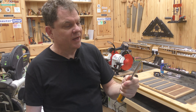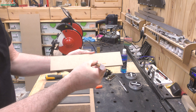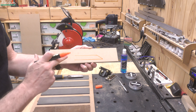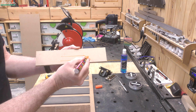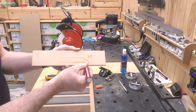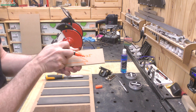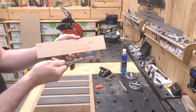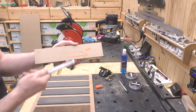We're going to bring this chisel to the point where it takes a cut fine enough to work oak. It's probably the typical type of chisel you're going to have. I'll start with a bit of theory on what we actually mean by sharp. A blade has a flat bottom, then an angle, then a top — that's the anatomy of a blade, whether it's a plane blade or a chisel. When it comes out of the factory, this angle is known as the primary bevel, typically 25 degrees. The bottom is usually not as flat as we'd like, so we need to work on that. The point we sharpen is that very very end tip. We're going to bring our chisel to a flat bottom with a 25-degree primary bevel, then look at secondary bevel theory.